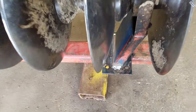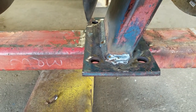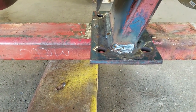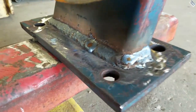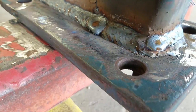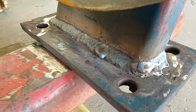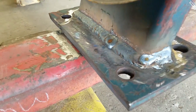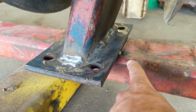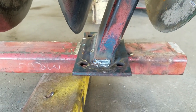And there it is all together. I started doing three passes on the end here — well, actually I just ran one pass. I had the MIG welder set kind of low, and I said, no, I think this will work a lot better if I just crank the MIG welder way up and just lay in a huge bead in there. And that worked a lot better — one pass, faster. So I like that. It ought to hold better than the factory one. I couldn't get clamps in here, so I ended up spot welding it in place on each side. About all there was to it.